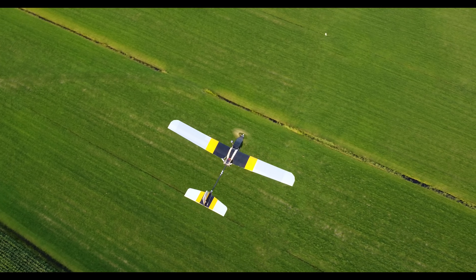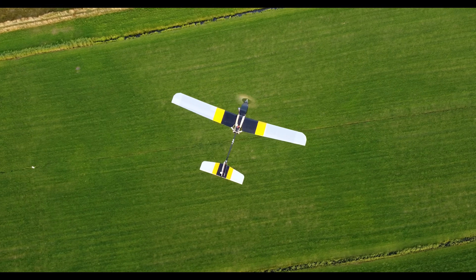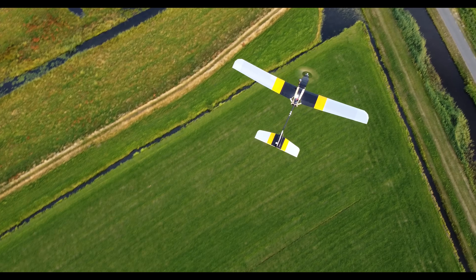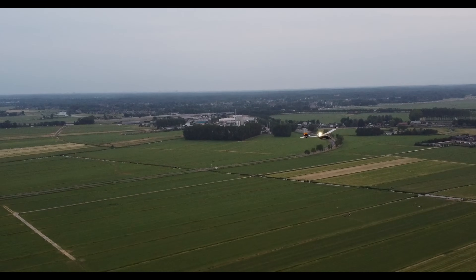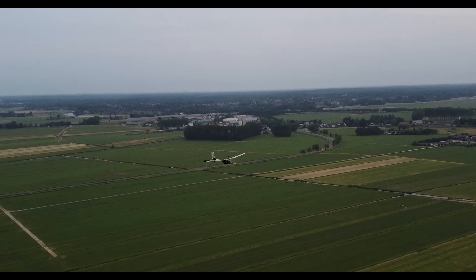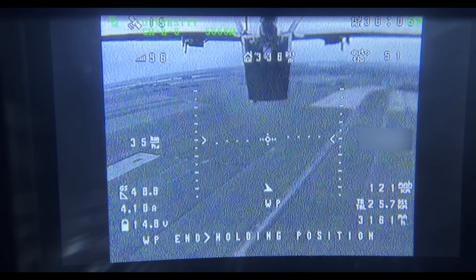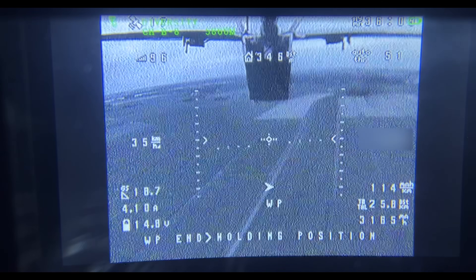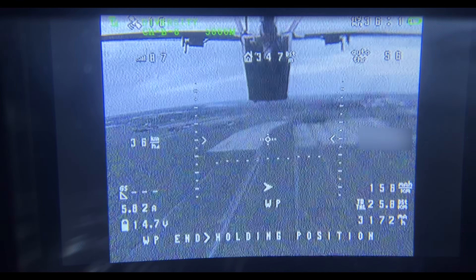My design of the 1.6 meter tractor UAV was to be as compact and low drag as possible. The curved nose was designed over the battery for the tightest space inside and the best aerodynamics outside. With its current efficiency of 120 mAh per kilometer I think it paid off. The rear-mounted FPV camera is an idea I got from RC TestFlight's Solar Plane V3, and I'm planning to increase that bird's eye view by mounting a panning servo for the full observing experience.